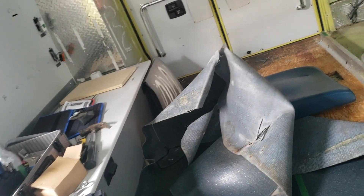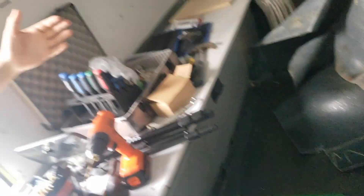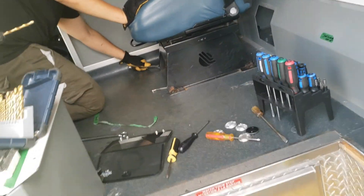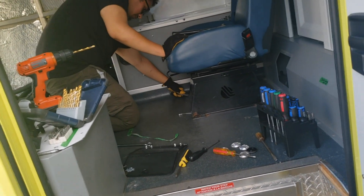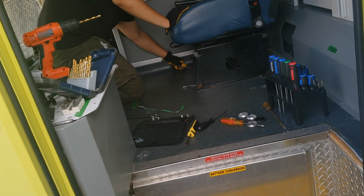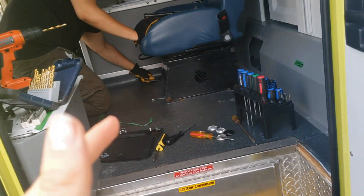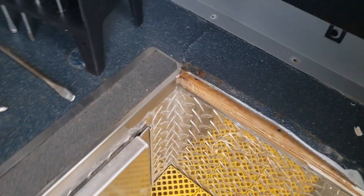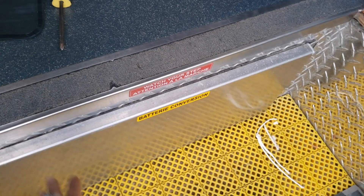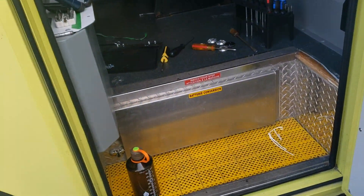We could take the dimensions and cut little pieces to fill them up - there's also a product we can fill it with apparently. Then removing the chair to remove the floor fully. We're removing the chair just for the time being to have more space to work, and as we lay down the floor we want less trimming to be done. I'm also working on removing the floor fully - it's quite hard because a lot of this stuff is glued on, so a lot of pulling, a lot of unscrewing and a lot of fun.